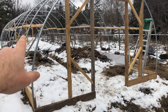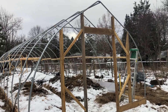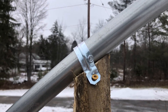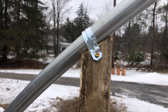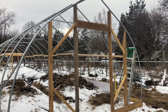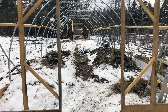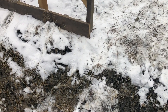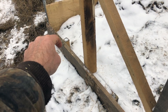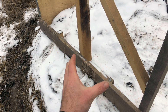I framed out the Dutch doors on the west end — you can see we used some really sturdy locust members to go up and meet this first metal arch, and that has those straps pounded over with a hammer, locked into the wood, and then a little tech screw zapped into the side to lock the metal so it can't slide around. Each one of these additional layers is adding some really nice structural rigidity. I put in these funky angle braces — I kind of like the look of them, it's like a hexagonal portal sort of vibe. Wherever there was some room, I pounded in a three-foot or longer locust stave, sharpened and driven as deep into the earth as possible, and zapped some screws in, so it's going to help with freeze-thaw shifting and pitching.